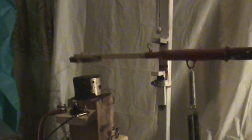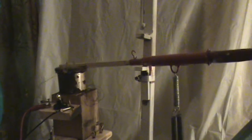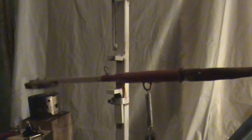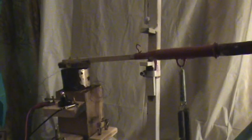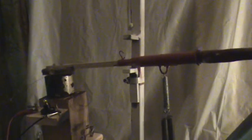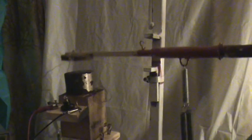It's very easy to maintain. I'm using a flashlight bulb right now — 2.5 volt, supposed to be about 0.3 amp. I don't want to blow this thing out; I've blown a couple already, so I'm doing it kind of easily. That translates into about 0.75 watt pulses — DC really, but I'm using a pulse machine. LEDs draw about 2 volts around 0.02 amp, which comes out to about 40 milliwatt, so that's why I wanted to stay away from LEDs.